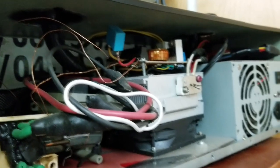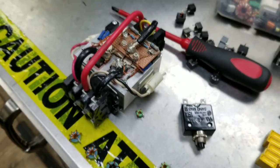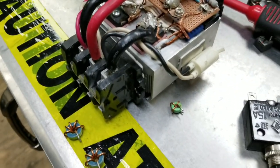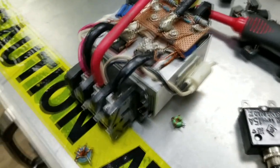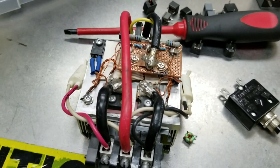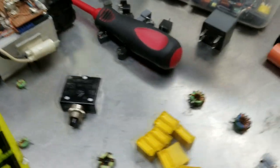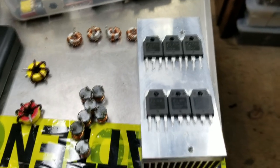This thing is pretty powerful and I'm just trying to make a version 3. This is the first version — it's pretty basic, neon light bulbs for protection. The second one actually outperforms this one because it's tuned in the right way. It has a separate gate driver for the MOSFET, so it's just better for that specific application.